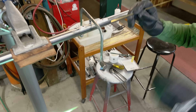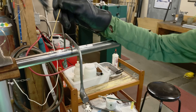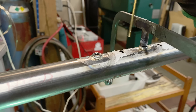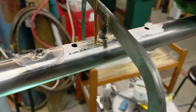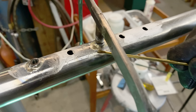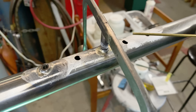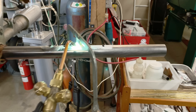You've got at least a quarter inch there — you need to get your cone closer. To me that feels super close, but that's not even close enough. You got kind of a blob and it did settle down, but yours is already spread out quite a bit. What you want to do now is melt it and flow it so you have a nice fillet that wraps around the braze-on.